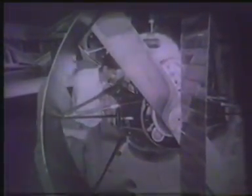This was still the original steel beam construction. The first five aircraft really didn't differ a great deal from each other. The biggest difference, I guess, was in the size of the duct. Basically that is the only difference, because with a 4 foot diameter duct, there just isn't enough thrust, that's all there is to it. This is still a fixed pitch propeller, so our performance was a little bit limited.